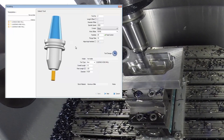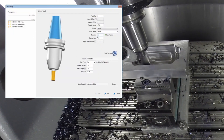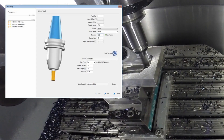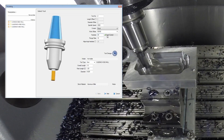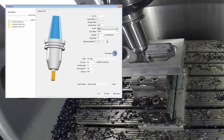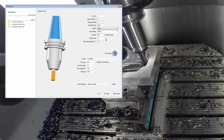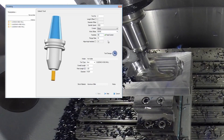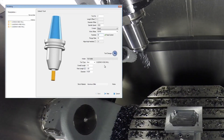The idea here is that even though we're slowing the feed rates down in certain situations, that gives us the opportunity to increase the feed rates for all linear cuts or when cutting large arcs — and then when it comes to cutting corners or small arcs, we slow that feed rate down. In real-world example testing, this type of feed control has actually reduced cycle time by up to 30% and more. A very powerful new feature of 1CNC XR7.